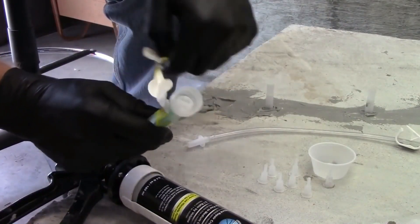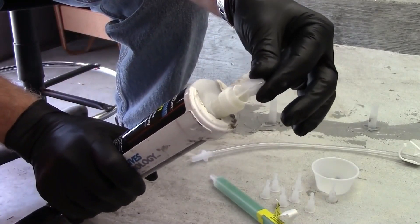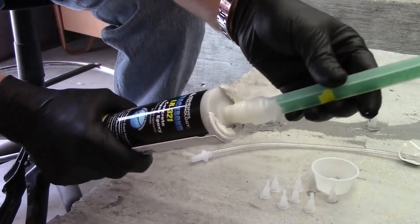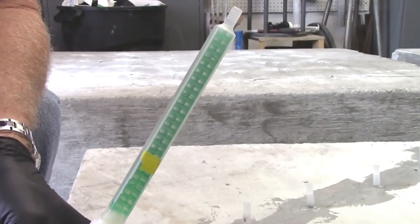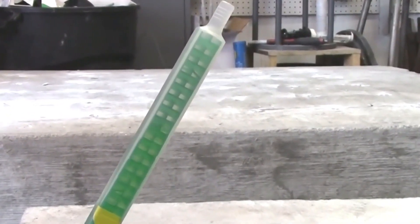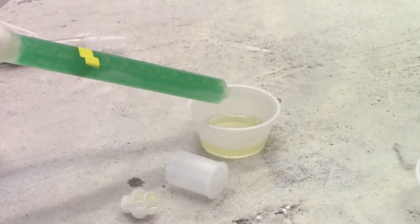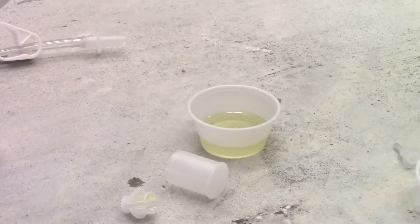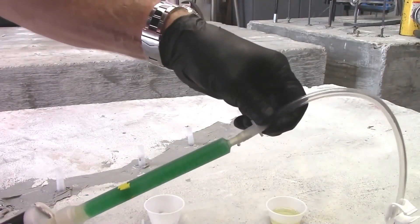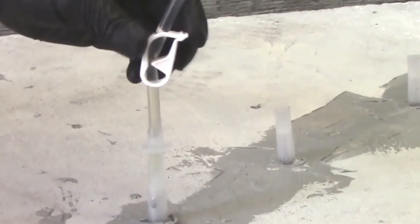Remove the flow control that's packaged in each nozzle and insert it onto the end of the cartridge. Attach the nozzle. Hold the cartridge upright while dispensing to purge out any air bubbles. Dispense one short stroke of material into a disposable container — do not use the material in the container. Firmly attach the tubing to the nozzle, then attach the opposite end of the tubing tightly over the tip of the first port to be injected. The flow clip should always be closed and only open while dispensing material.